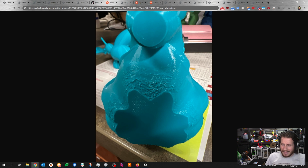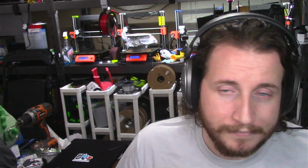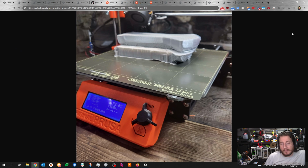And I feel bad because obviously I did not answer this one for him, but I would normally say that this is something that has to do with your ramming problems, but 50 out and 25 in, you should be okay. Could be everything from the PTFE tube is finally degrading, maybe a partial blockage of your nozzle, all the way to your filament's not hot enough, and it needs to spend a little bit more extra time in the hot end before it can be easily extruded. Multiple options here.